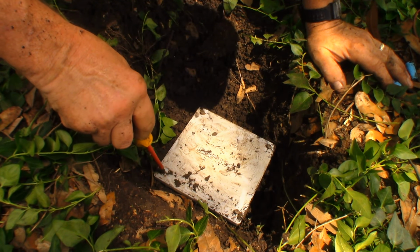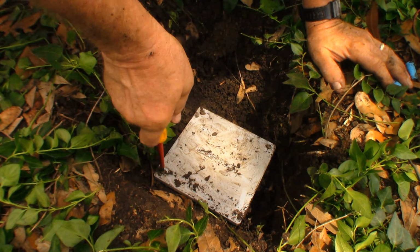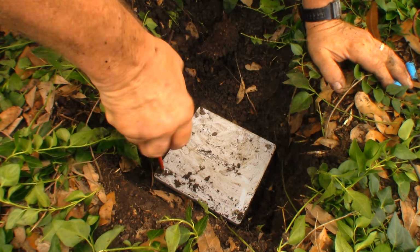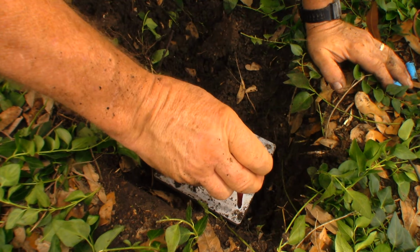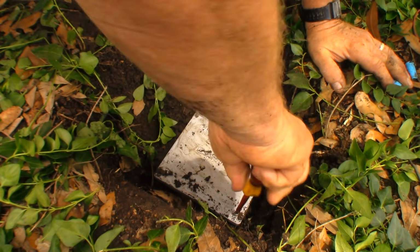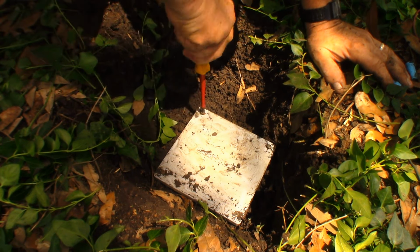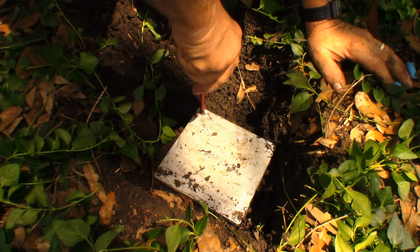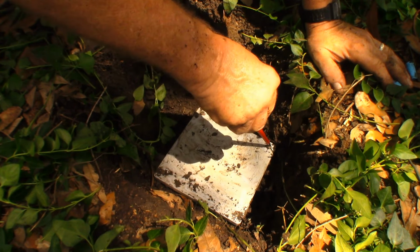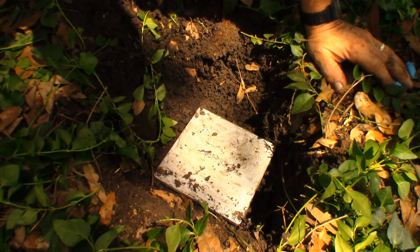Yeah, I never like to bury these boxes this deep. I wouldn't have done this type of repair. I would have cheated this box back towards the source and then brought that wire up to ground level so the top half of this box is exposed. That way, if there's an issue, whoever's working on it again knows that there's a box there.